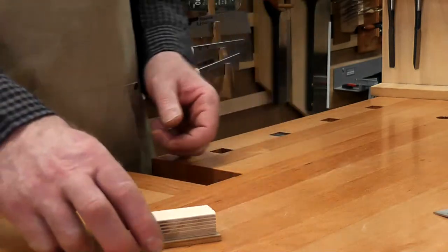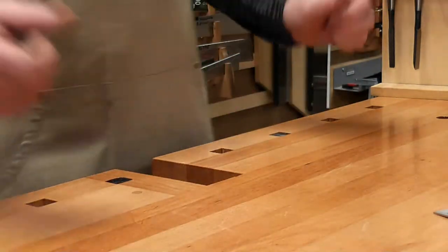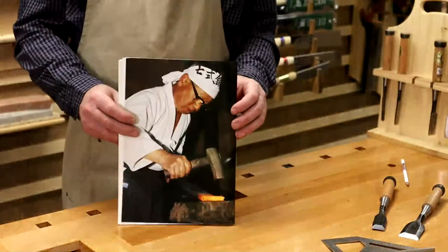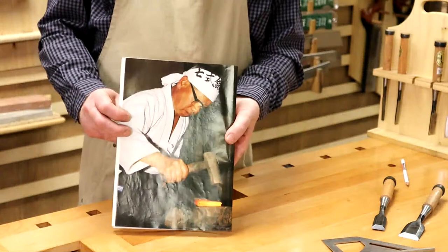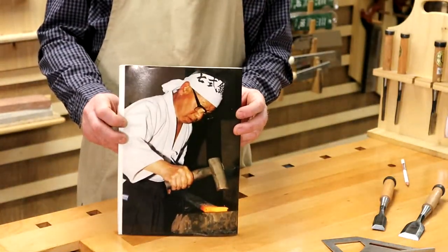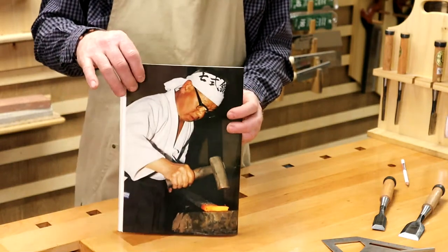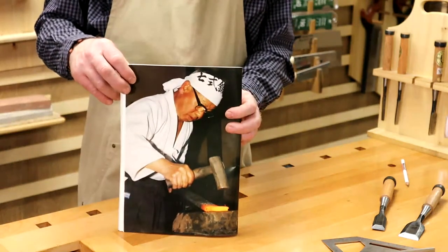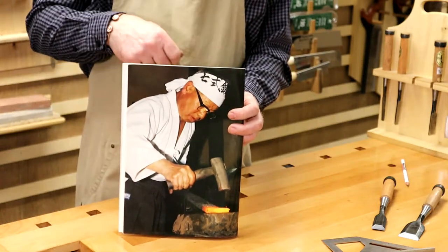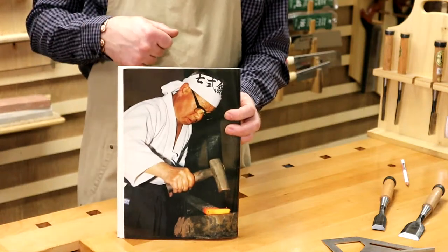And they basically put this in a forge. Now, unlike your Western style chisel, that's machine produced these days, CNC lathe or mill, and they mill them out, your Japanese man, they're still actually hand making these. I won't say it's all done with this man with a hammer. They will have pneumatic hammers now, or motorized hammers, to do the heavy beating, but they're still using a forge in exactly the same way as they were maybe 200 years ago.